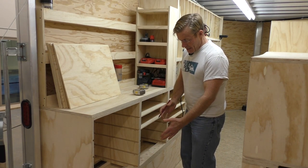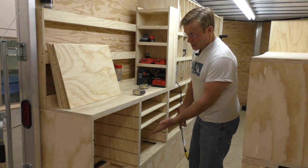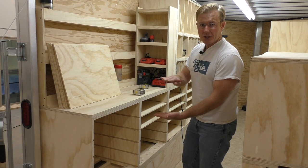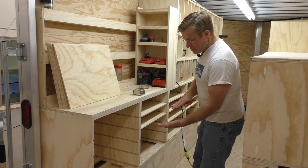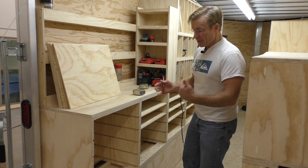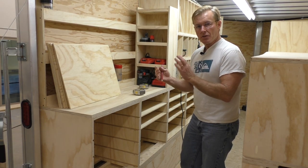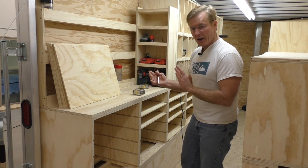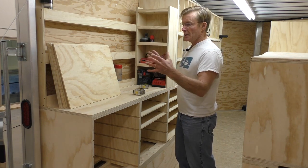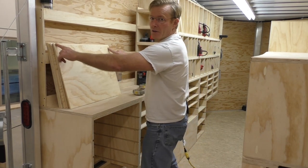The first one I labeled number one, and because of the way I'm measuring I started with the bottom one. I'm making the sides go from up to the next drawer minus a half an inch. Because the width and the depth are different, I want to make sure I put the dados — the side dados on the side and the front and back dados — on the correct faces, so I don't get them turned around at the saw. So I'm making a mark on the two sides so I know these are the sides.